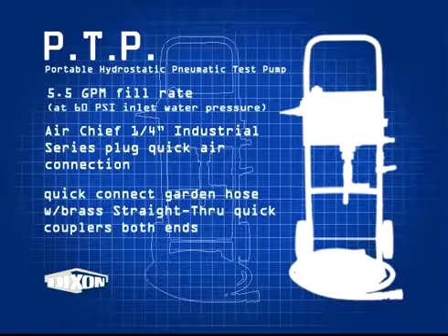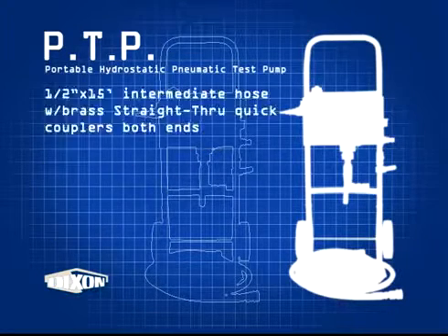If no hydrostatic pressure exists for the hose to be tested, use 150% — one and a half to two times the assembly working pressure — and hold that for 15 minutes.